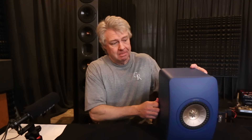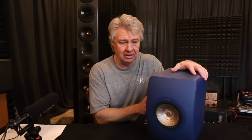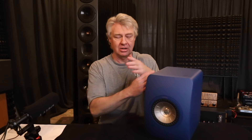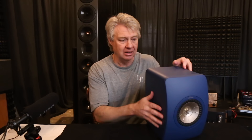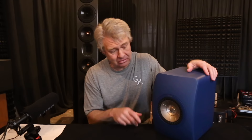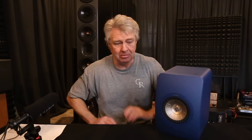Binding posts were pretty decent. I didn't see ferromagnetic material anywhere on this side. Overall it looked good. Then we opened it up and this thing is well built — it's a tank. It's solid, there's no cabinet resonance. It's definitely different from the Q100 and Q150s in that they more aggressively braced it with a big cross brace running through it. It's three-quarter MDF, so it wasn't expensive. The curved front baffle is definitely functional — it's going to minimize surface reflections and make it sound more transparent.